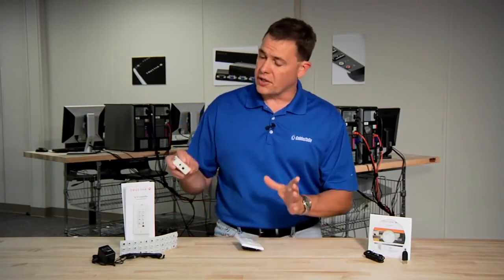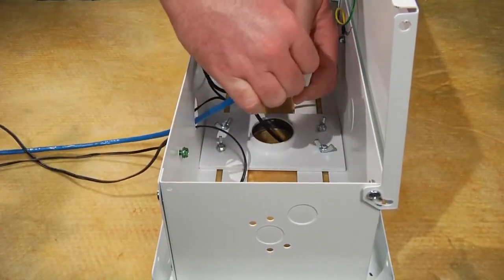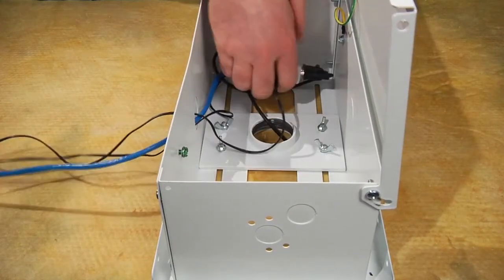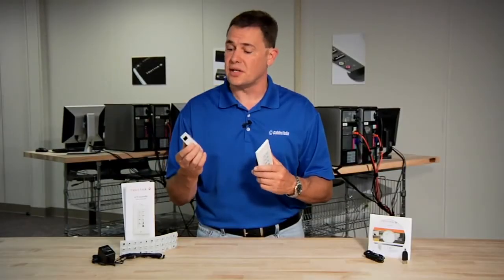Our kit also includes the multi-port controller interface adapter. This is an adapter which, for a very simple design, will go in close proximity to the device you want to control. It features a Cat5 jack, and we feature a simple one-cable design which is run from the adapter down to the controller itself. The signaling and all the power is through one Cat5 cable for an easy install.